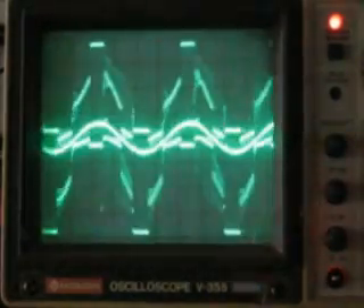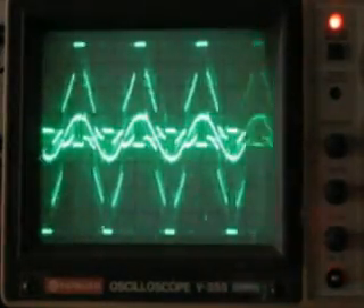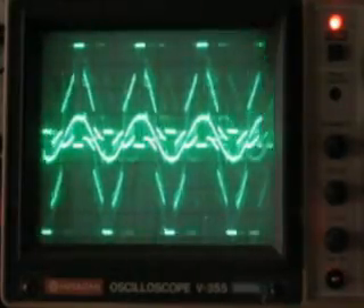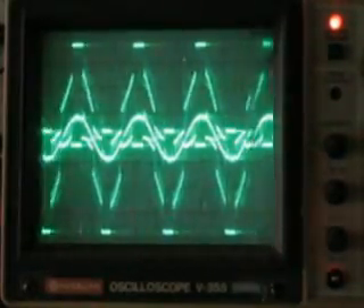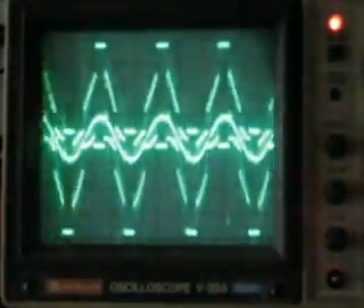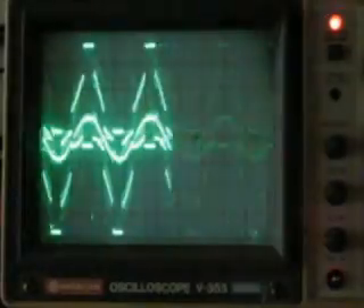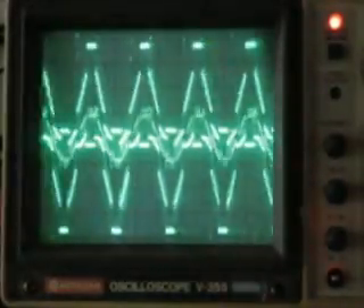There's no RPM on the motor right now. You're going to hear it start up. You can see the waveform is essentially peak-to-peak equal to the battery voltage, which in this case is a two-cell lithium polymer — that's 7.4 volts. The output waveform for the phases is a combination of frequency modulation as well as pulse width modulation.